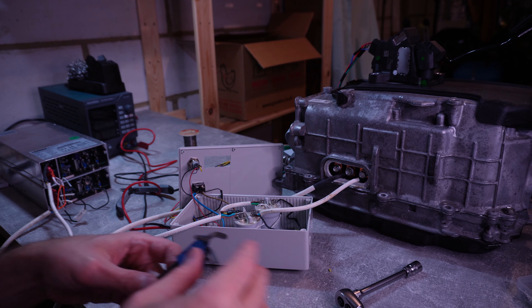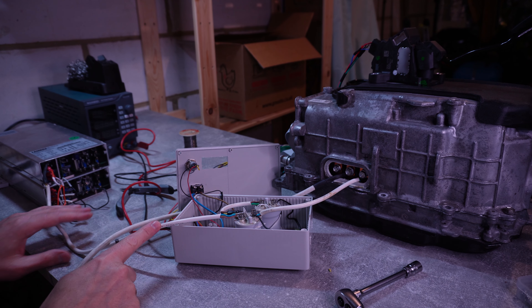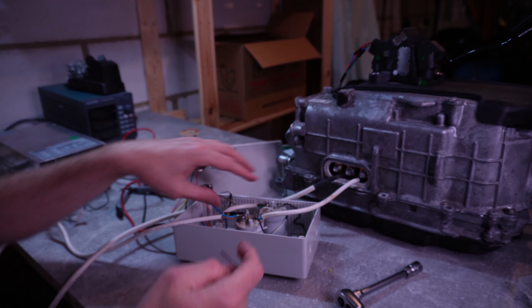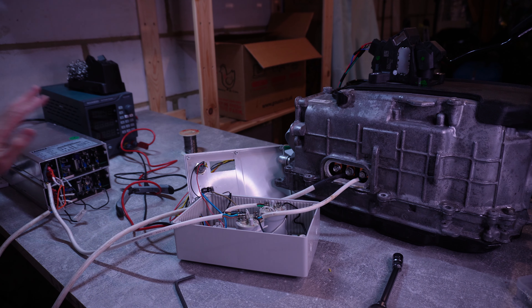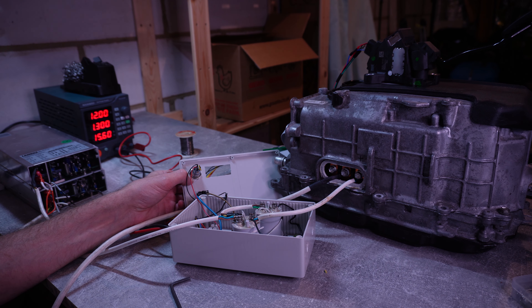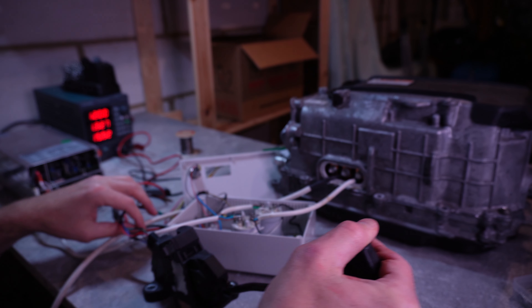Right, I'm now finishing the connection of my project box. I've now connected the contactors. This is the main contactor here and the connection goes to the power supply, and this is the pre-charge contactor with a resistor here. Today I finished the battery connection and the connection for the pre-charge contactors and connecting the inverter plus and minus. So this is our battery supply, though I'm still using the power supply in this case. The power supply is on now, I apply the voltage, switching high voltage power supply. That is on and we can now apply the power to the inverter and the box. The contactor is on and this goes through pre-charge, now I'll press start and this should hopefully start the inverter so I can try applying my throttle.